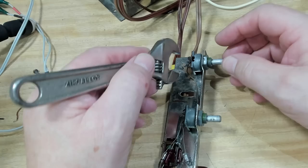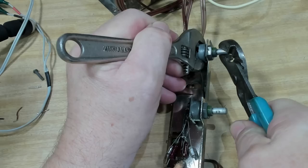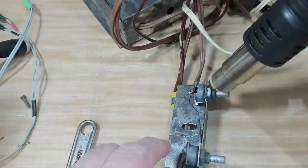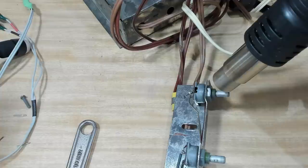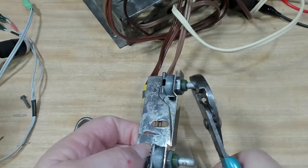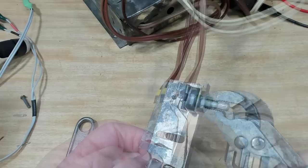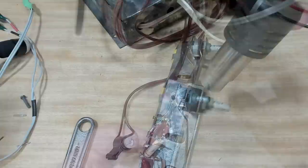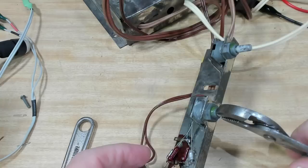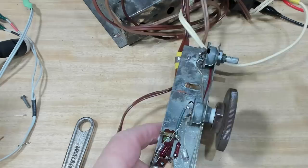This has been soaking for quite a number of hours and I don't think it's going to move - it won't budge. I might try a bit of heat on it. I've got about 300 degrees going into that. This may destroy the potentiometer but I can put a new one on. That should be hot enough - let's give it a go. Wow, that loosened it straight away - look at that! So the old Garrard turntable method worked fine. I might as well do this one as well, and the other two on the other speaker are exactly the same.